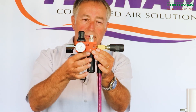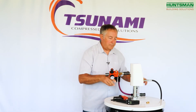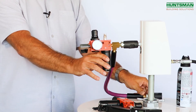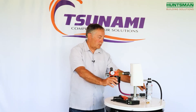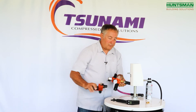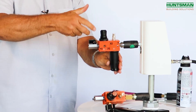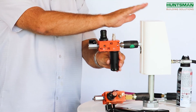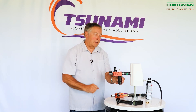This kit comes with a regulator so you can regulate the air pressure, and it comes with a lubricator. One of the units has a tee port, so if you connect it to the drum that has the extra air motor, you can plug this in and now you're lubricating both the air motor for your piston pump and the air motor for your mixing valve. The other connection just has the lubricator. It has a regulator so you can adjust pressure and avoid over-pressurizing — only using the amount of air required to make your pump work, which saves wear and tear on your compressor.